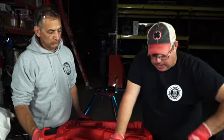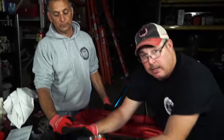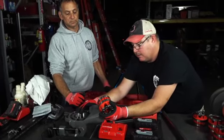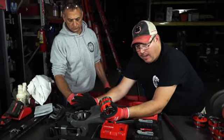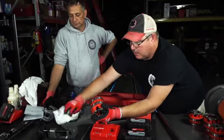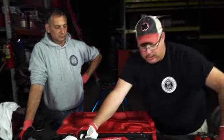What I would tell you is that a great recommendation is not to use carb cleaner on the Milwaukee. Don't use it on your dies and don't use it on here — you're going to do damage to the head. You don't want to break down the oils. The oils are good for this. Wipe it down with a towel or paper towel — you just want to wipe it down, but that oil is good for it, so we don't want to totally get rid of it.